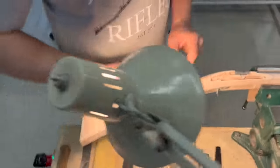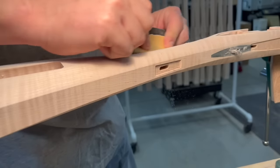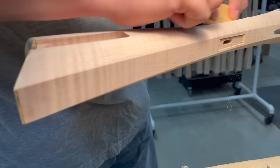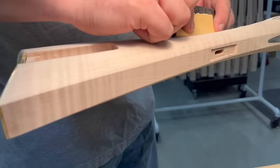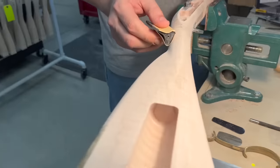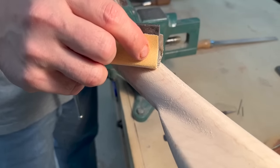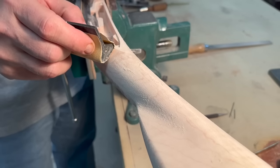So now we're just going through the whole thing where we're just sanding. I'm pretty much sanding with the grain, even though if there's curves, I still sand with the grain. So a good example of that is up around the lock moldings. Some people are tempted to kind of sand around the lock molding like that. And what usually will happen